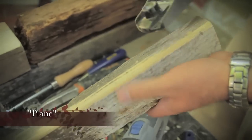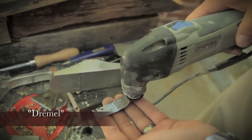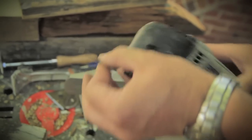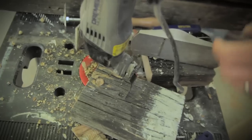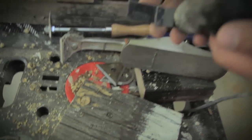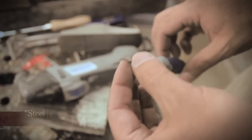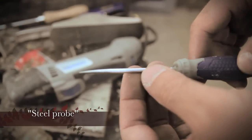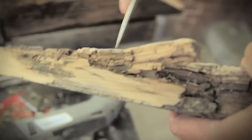The plane is very good if you're trying to make a new piece of wood that replicates the original and you've got something like a rounded corner — you don't necessarily need power tools for everything. Here is a power tool: a Dremel Multimax, though different manufacturers make similar tools. Really good for plunge cutting — it's got a narrow, thin blade and if you've got just a small section of wood that you want to cut out, you can cut in straight and cut out just a small square inch, great for getting into tight little corners. And just a little steel probe or screwdriver tip is useful to go around and find out which areas of your wood are solid and which are not.